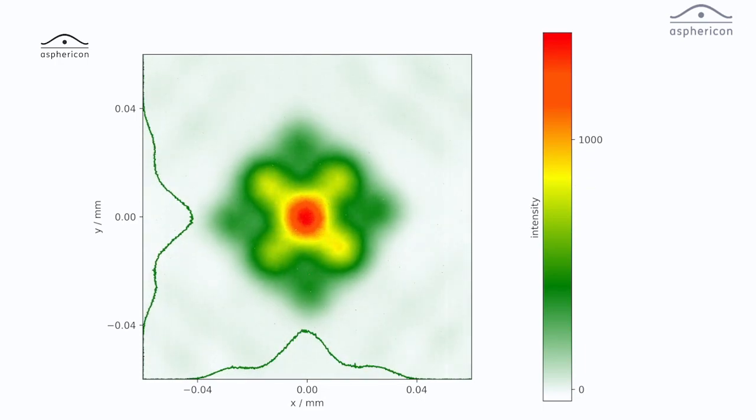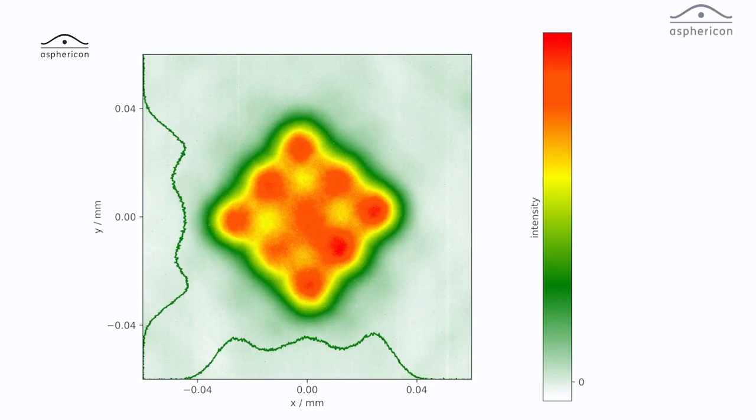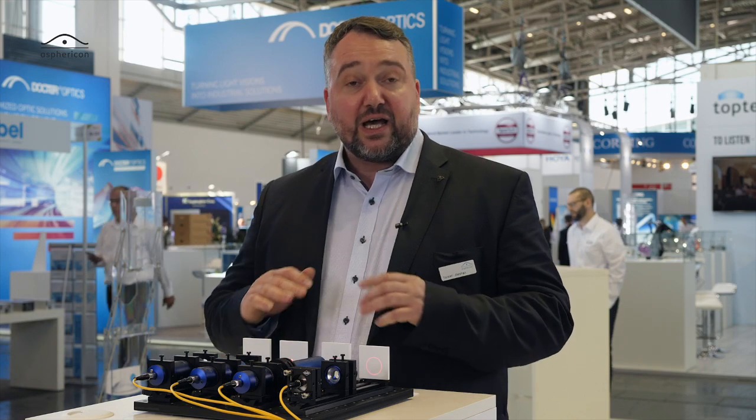At the end we will see something like a chessboard structure. It's all for your flexibility, offering a wide range of applications, and it also looks pretty cool. The Squarey Shape has already been tested successfully within material processing, in a process called LiPS — Laser Induced Periodic Surface Structures — because it enables bringing very defined structures onto metal surfaces.